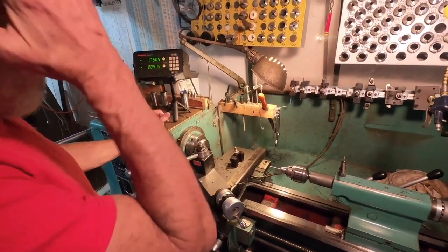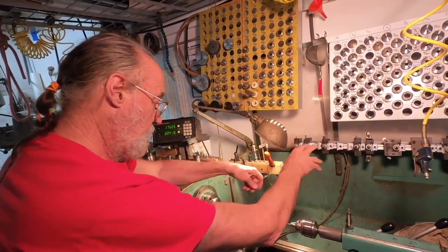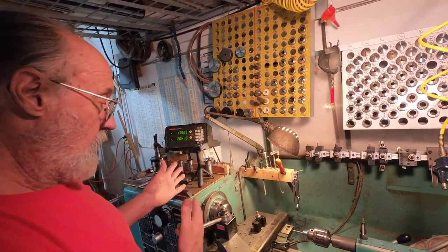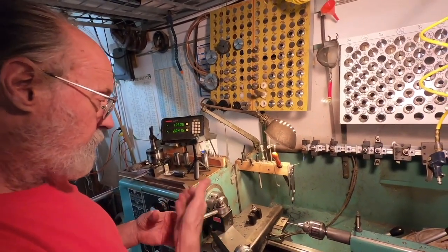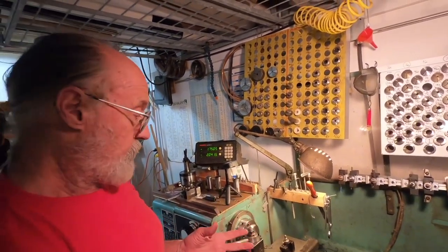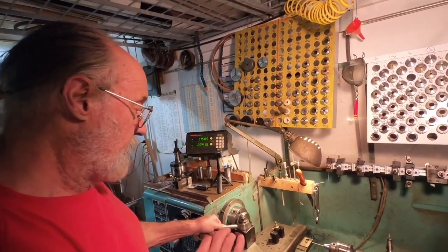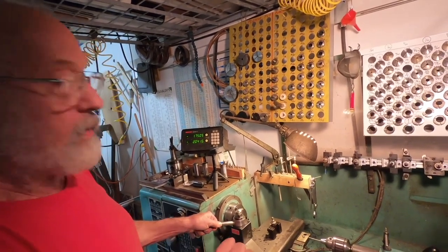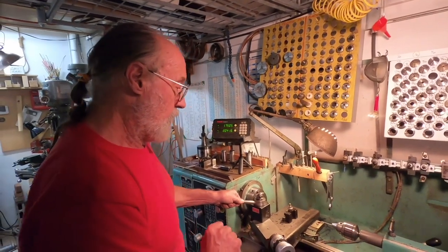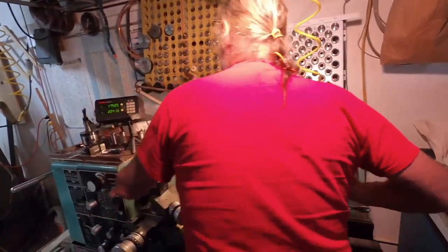Going to drill with this drill, and the problem with drilling with a small drill in a soft material like this, it's soft but it also may have a hard spot or a wiggly grain that'll tend to make the drill go sideways and not drill straight as a result. So what you want to do is try and figure out how to drill in a sensitive way so that you're not crowding the drill and getting too much heat and too many uncleared chips. Ebony is kind of gummy and tends to stick to the tool.